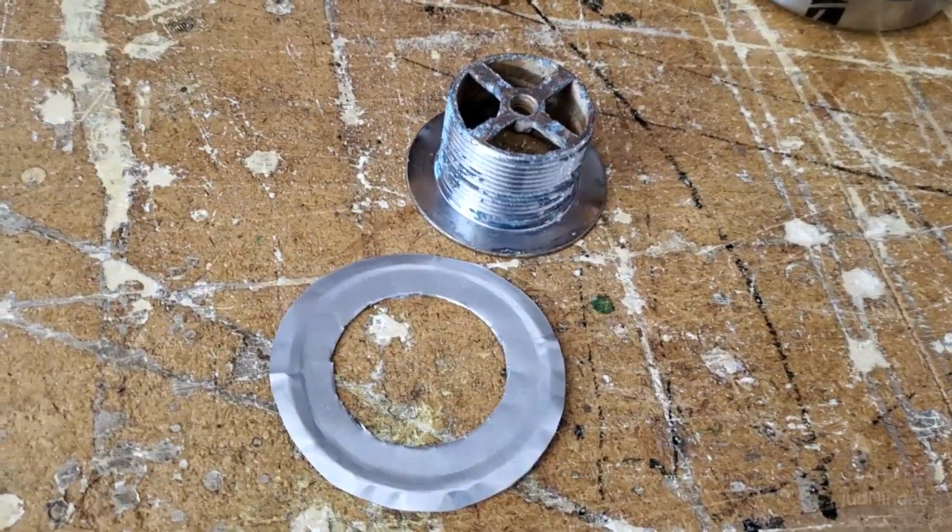So the next step is I have to sand the heck out of the patch area because I have to remove any surface traces of the super glue, because the epoxy does not stick really well to the super glue. It will, but it's not the best bond. Plus it'll smooth off some of those little ridges I've got. So that's next. We're back in the tub.